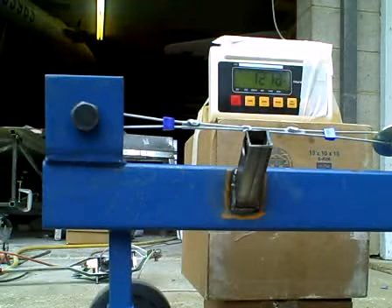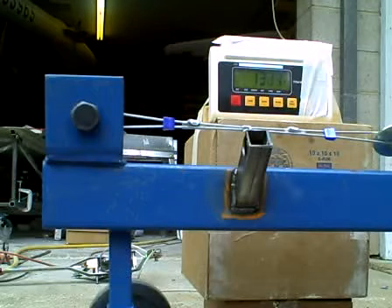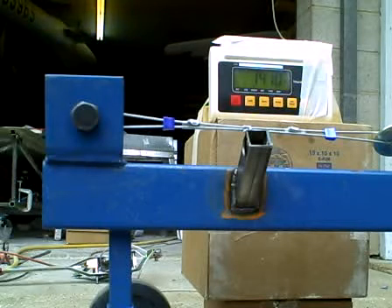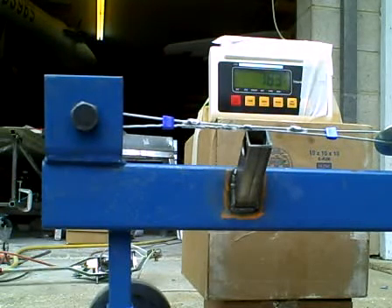There's 1,200 pounds force. I'm going to keep it going right on up. We're well past the rating of the stopper — 1,280. There's about 1,300 pounds force. And I can hear some crinkling noises coming from the wire. 1,300 pounds force, 1,370, 1,380, 1,400 pounds force — and I can hear some crinkling. 1,400, 1,450 right there. You can see the wire breaking.